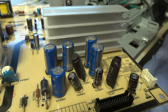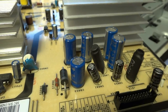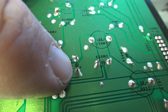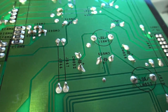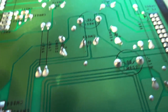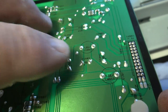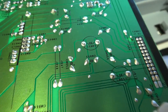We'll put the set back together and show you how everything works — it's going to work great when I'm done. Here are the two capacitors on the circuit board side. The positives are connected together and also the negatives — they're going through a coil, with one on each side of the coil. This is the filter for the standby power supply. In order to measure these with the ESR tester, we're going to need to disconnect one leg of each capacitor so that we can get an accurate reading.